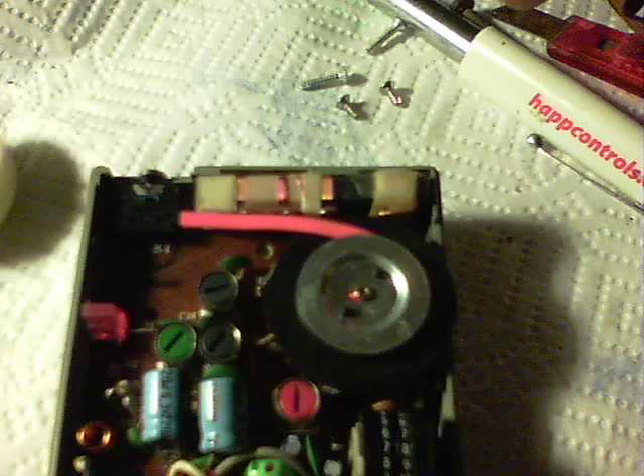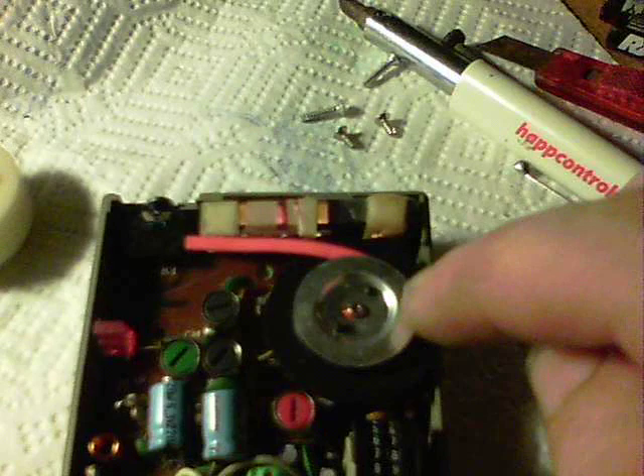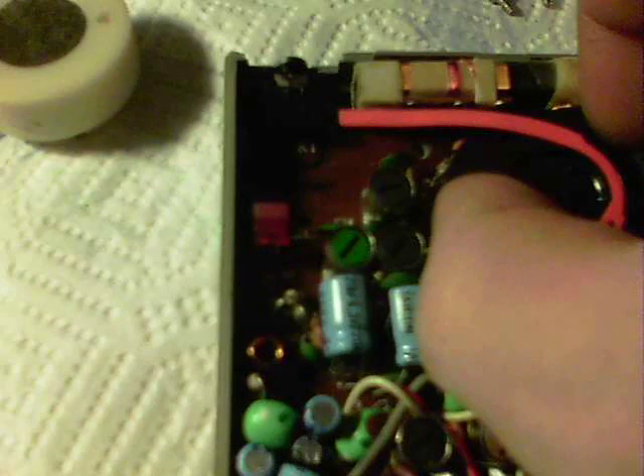It's quite old school inside. There is an LA3361 chip which will be an RF stage — it may handle both AM and FM. I'll look up the data sheet. What we're going to do is put seven turns of about 30 AWG wire along the whole length of the ferrite piece. It looks like there are a few turns for FM in the red section and the rest for AM in the yellow. We'll connect those to the tuner underneath, which should give shortwave capability.